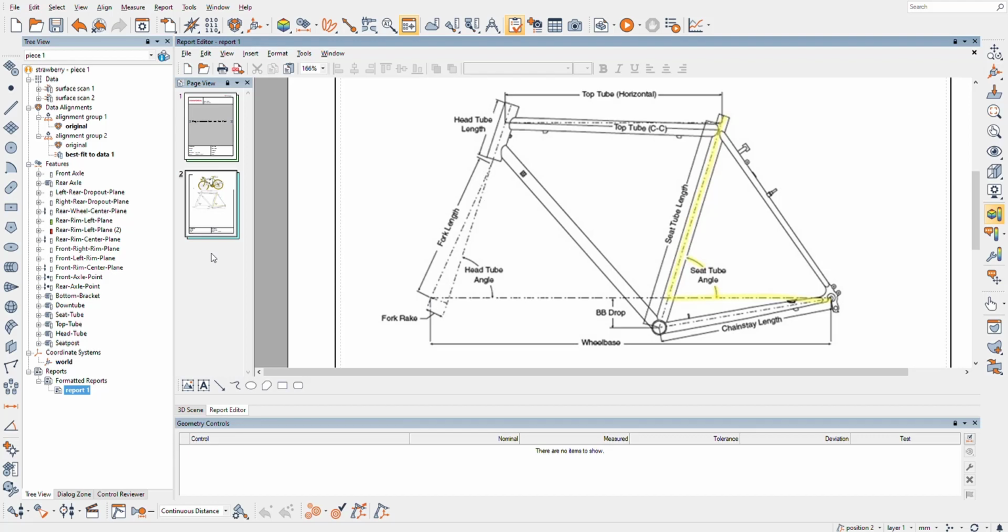I'm gonna think about how to do it in PolyWorks. There's a way. It'll be length from this point, and then if I extended this tube by that same length, but at the same angle, then the difference between these points. So we should be able to do that with a projection, I believe. So we could just do 90 degrees from the head tube angle all the way to the fork, to the axle. We'll think about it a little bit. We'll get through it when we get there.